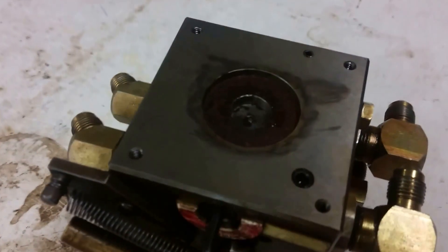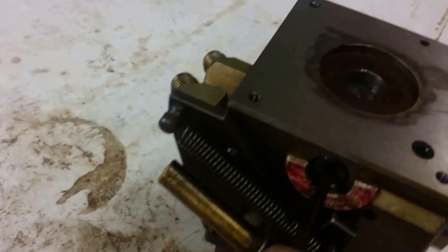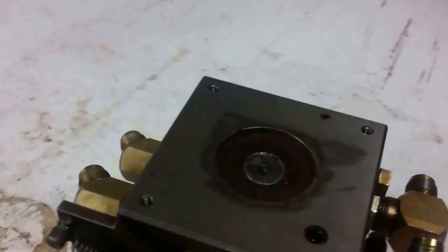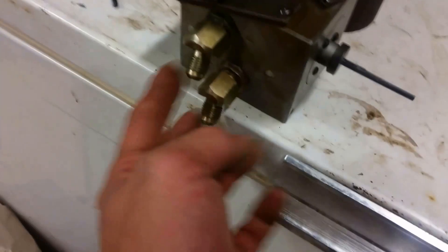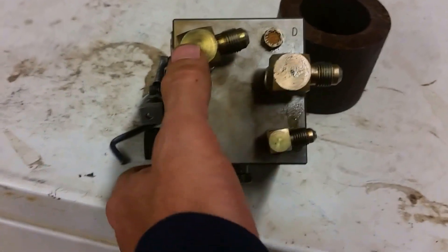There's a thing here called stylus pressure. By turning this dial, it lowers and raises a pin. That was all corroded and seized in the down position, which I think was preventing the hydraulic flow from going back and forth. There's a stylus on the bottom and you can set the pressure to be light or heavy. These two ports go out to the cylinder on the tracer.